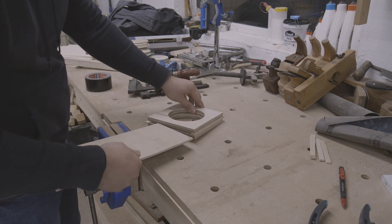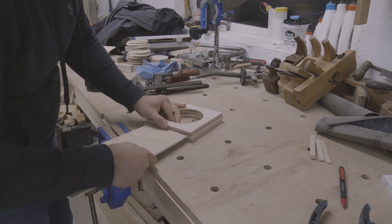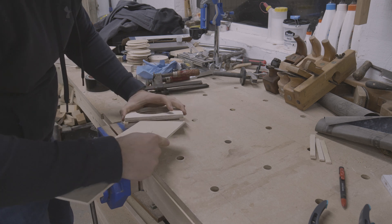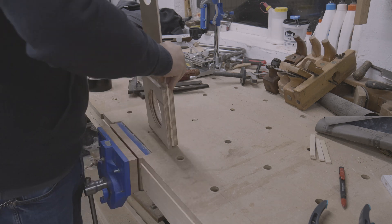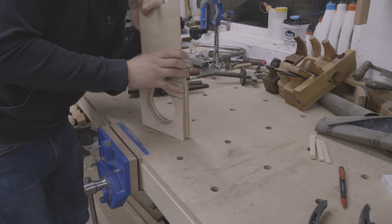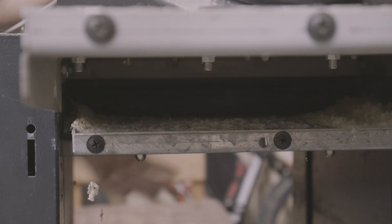That was a little too tight for the sliders. I thought if I cut the sides out of the same plane as the slider, there should be just enough space to fit them, but the tolerances are too small to get them in between. That means I have to plane and sand the sliders flat again. The engineer speaks here of a transition fit.